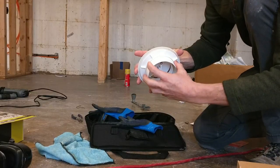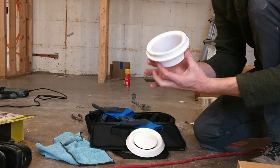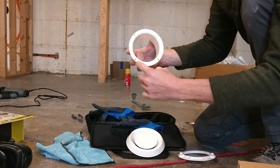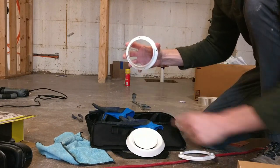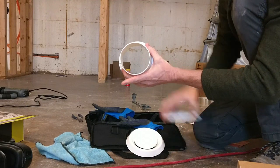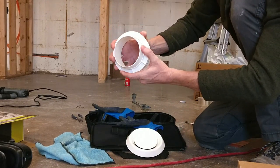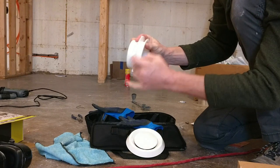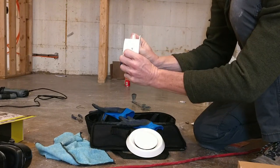And so the pieces that I'm using are a little bit different than, say, ductwork that you would have for a standard house. What I have chosen is this piece right here, which is an air diffuser. So this piece comes off the face of it. And so you have this piece here. Take this guy off. There we go. So you cut your 4-inch circle right in your drywall, and that slides through. And then on the other side, this piece comes in like that. And that's what clamps on the drywall. And if you want to, it has screw holes. Then you can run your screw through the drywall and connect into this to make that a nice rigid fitting.